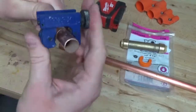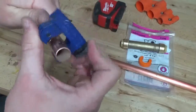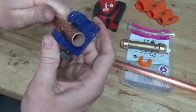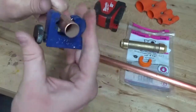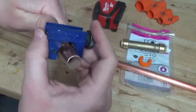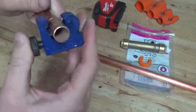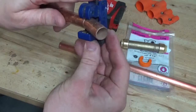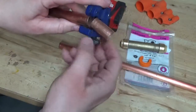Keep spinning until you feel that sensation again — it will just be slightly easier to turn than it was the last few rotations. Screw it more, and you may need to do this three or four times to cut through your segment of pipe.